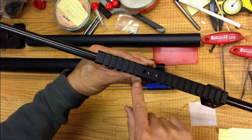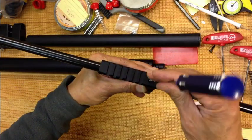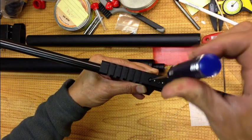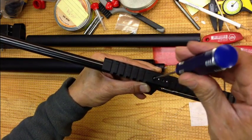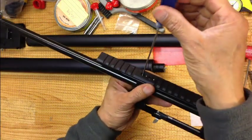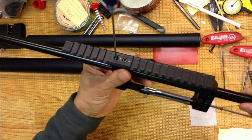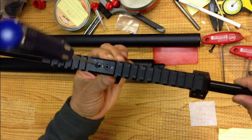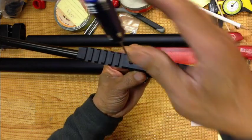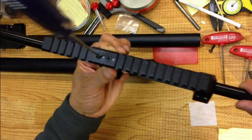When you see the indent, you've got to hold the barrel in place while you screw in your alignment screw. Scroll it all the way in and verify it doesn't move. Back out on it a little bit — about half a turn. You notice you can move it forward and side to side, so you know you're on the indent. Lightly seat it only until there's no movement on the barrel.